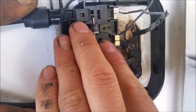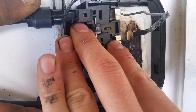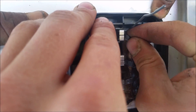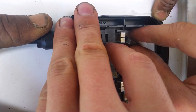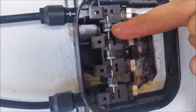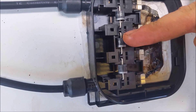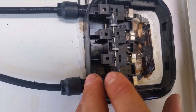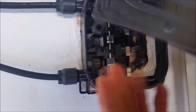The diodes go from negative to positive. If you're standing on the back side of your panel with the cells facing away from you, negative is on the left side. The orientation is: negative, positive, negative, positive, negative, positive. So don't get confused. Now just seal it tight.